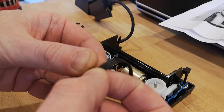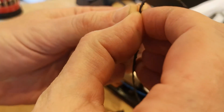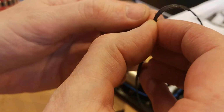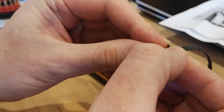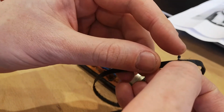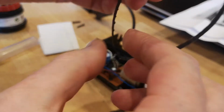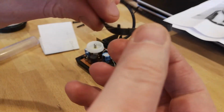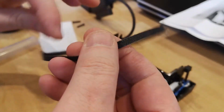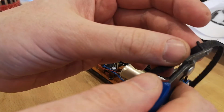if you look at the stylus, you'll see that there's one leg that's higher than the other, and that leg also has a shorter end piece. Now the leg that's higher needs to go on the inside of the band. So the teeth of the band are on the inside, because they're what attached to the cogs, and the leg with the short end bit and the higher leg goes on the inside, and the leg that pretty much sits in line with the band and has the longer end piece goes on the outside.